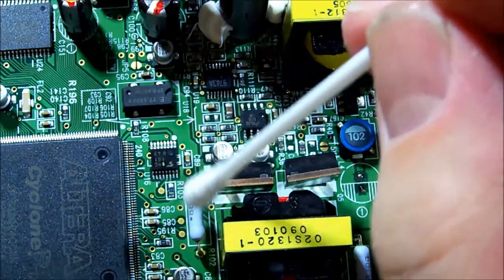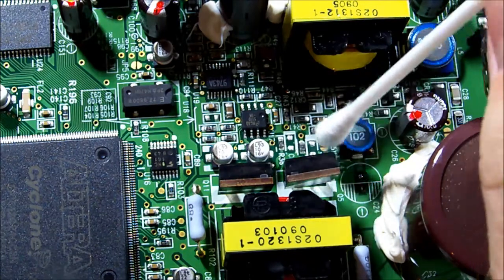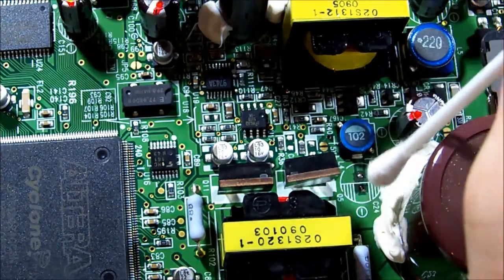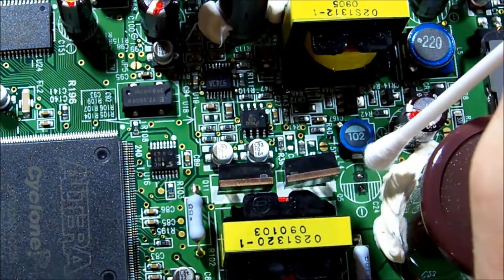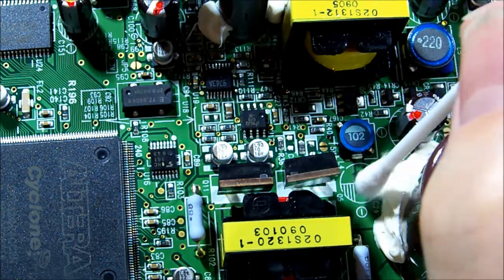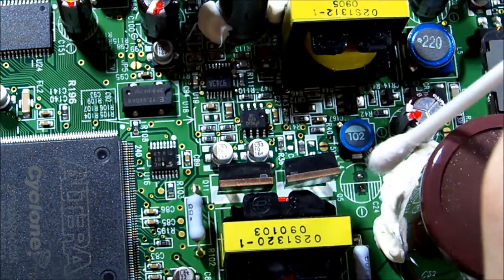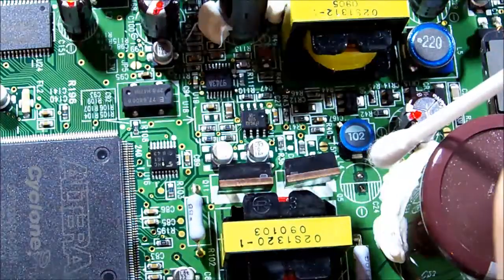The leakage ran all the way down through here and pulled around the leg of this blue resistor - I've cleaned that up. There appears to be some corrosion on the pins of this transistor down the board, so I'll double-check that's okay. I need to rejoin the trace back up to the pin of that capacitor. I'll wick the solder out of the holes, clean those up, and find another cap - it's rated 16V 100 microfarad - I think I'll have something here to do the job.